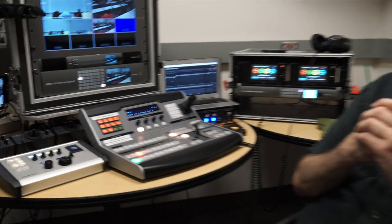I don't have any HDMI cables longer than about this long. Any device where it doesn't work and you unplug and plug it and then it works — that worries me. That's really the strategy we've used for engineering these setups. ClearCom is really, really great. We have an RTS system as well, but I would not recommend RTS at the lower professional level. The rack unit is a little flaky and does not take program audio in a straightforward way — it's designed to interface with some other box to get it to the right level. Really wacky.